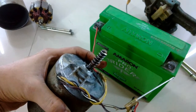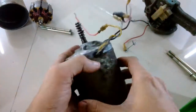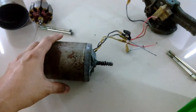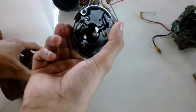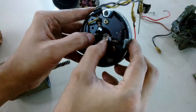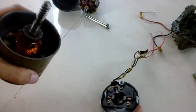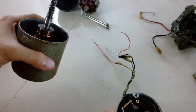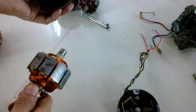Judging by the speed, I can say the first motor's coil is somehow shorted — that's probably why it wasn't reaching full speed. The second motor's brush section was seized, maybe due to lack of lubrication, and that's why it wasn't providing adequate contact and the motor couldn't run at full power. The brush section from the first motor has its brushes and bushes all well-lubricated and in fine condition. So what I need to do is rewind the first armature since it's shorted, and I'm going to clean the second motor nicely and smooth out the top wiper gear section.